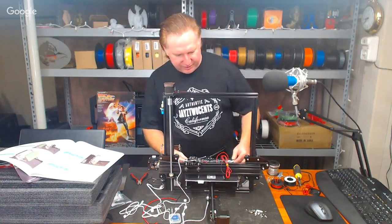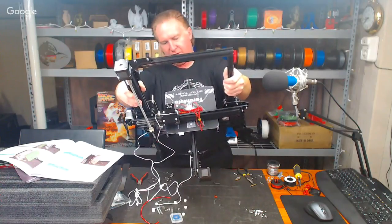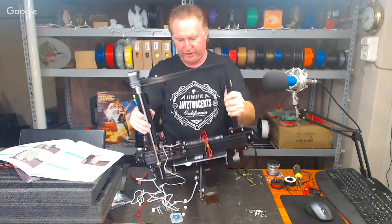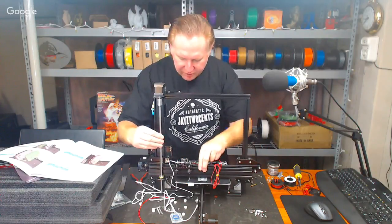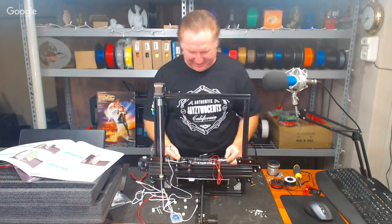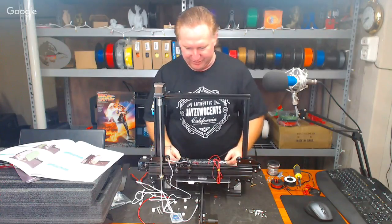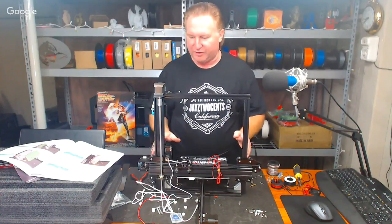Well, I'm hearing a noise I did not notice yesterday. What is it? I didn't readjust those nuts at all, so I don't know why that's... Well, you know what it is? It was the nozzle. I didn't adjust the nozzle height all the way yet. But that's what that noise was, it rubbing against the PEI sheet. Okay. So anyway, just went through and readjusted stuff like that.